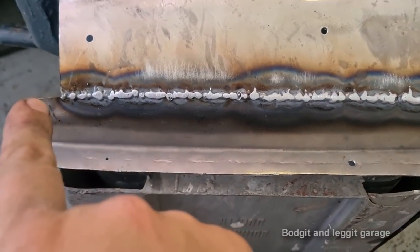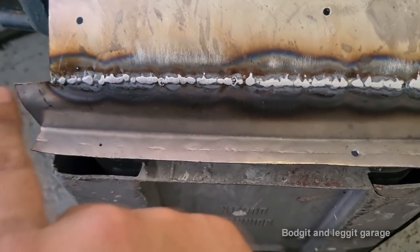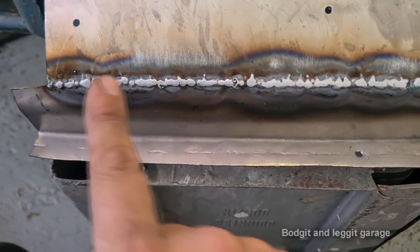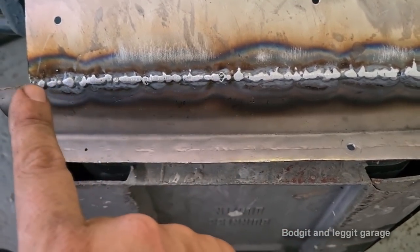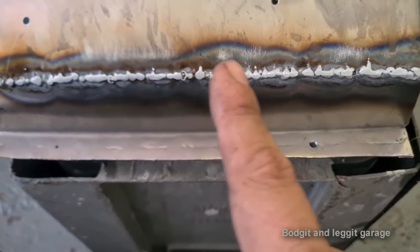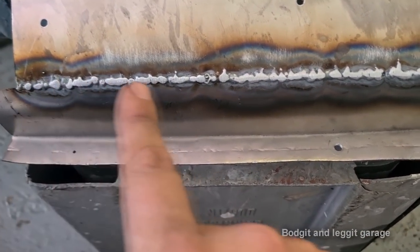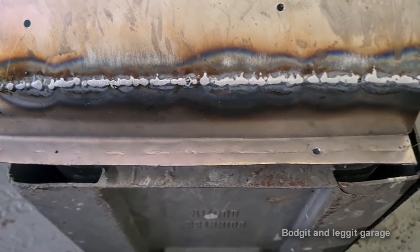So yeah, I just started grinding and I realized I just wanted to show you. There's just loads of little spots. It never looks nice because it's just spot after spot, but you weld about every inch, every 25, 30 mil, and then just go back another spot, another spot, another spot. Slowly join them all up together, grind them back, and you're gonna have to go through a few little spots again, grind it back, and then you get your final finish.